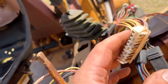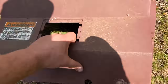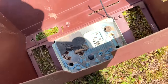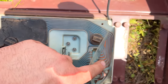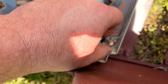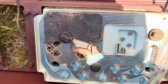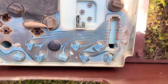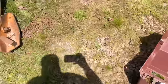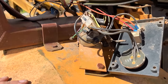We've got our gauge panel actually just unplugged for right now, and the reason for that is, we flip her over. On the back of this is really common. You see it in 80s, 90s, 70s cars, are these kind of plastic printed circuits. And we've got a couple of them just completely off and shorted. So I'm gonna check and see if I can get just that backing plate, how much that is, or we'll just glue that down and clean those contacts up and work on getting the gauges working. But yeah, we've got a bunch of stuff.